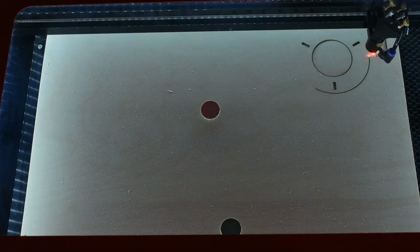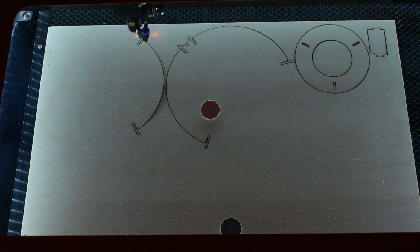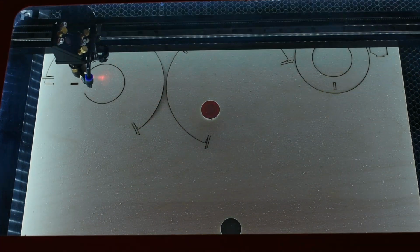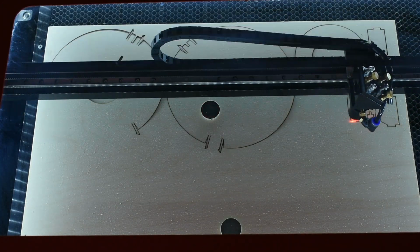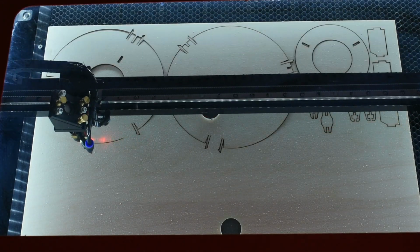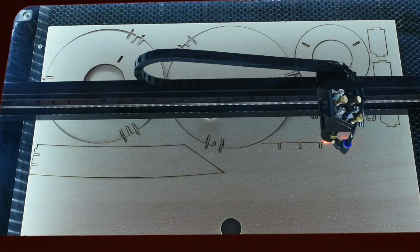I've already created the template needed to laser cut the parts, so the first step is to download the files and laser cut the pieces for the coffee tower. The design uses about 1.5 18 by 24 inch sheets of 1/8 inch plywood. I try to make sure that the largest pieces are about a foot long, so even smaller laser cutters can cut all of the pieces.